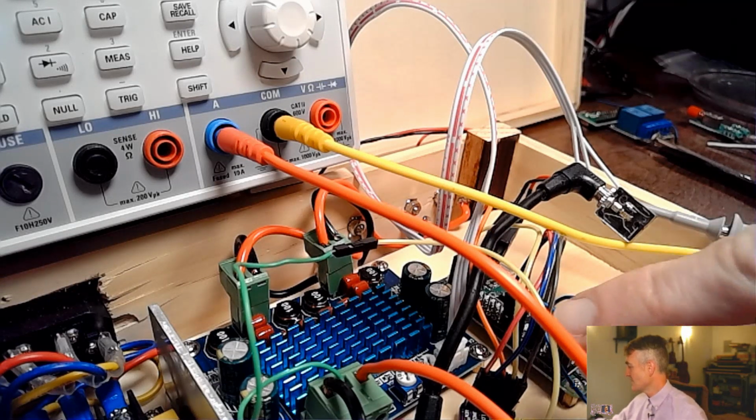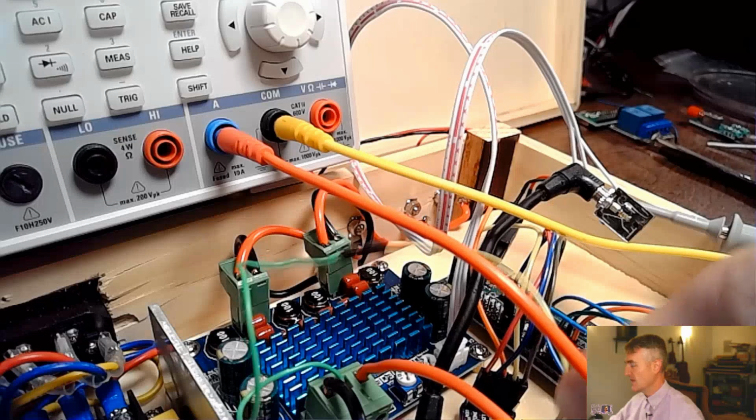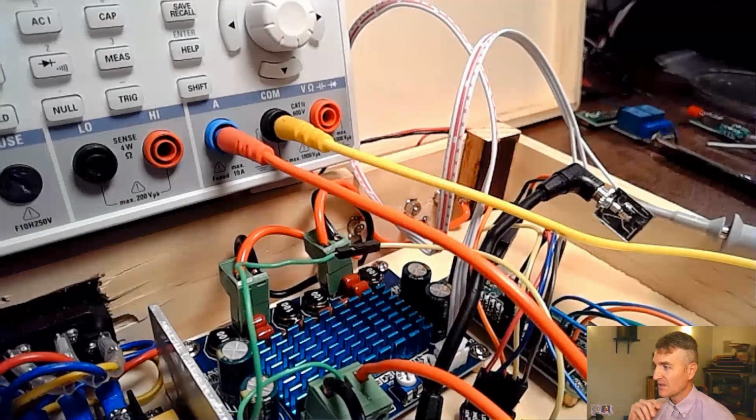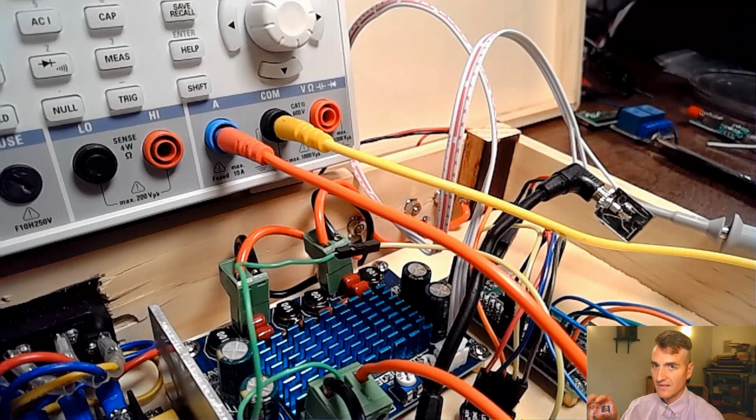Right now, I'm just connecting this pin from VDD and ground, but I want to automate that. And it doesn't actually require any current to activate this. You just need to set this to a voltage level. So the GPIO pins on the Raspberry Pi are great. They're great at setting voltage levels. The chat says I use an educated guess to choose GPIO 12. Yeah, we'll say that. Educated guess.